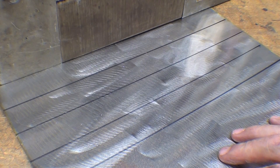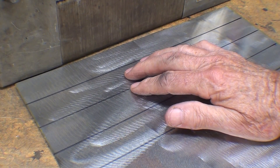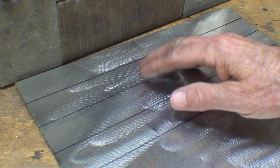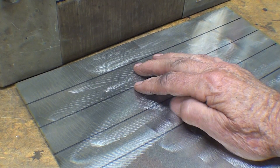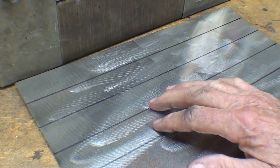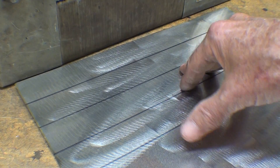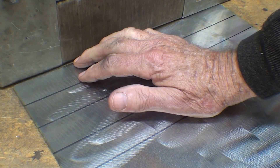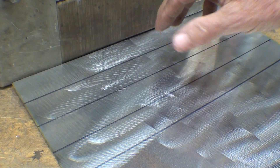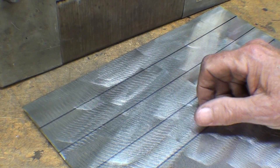This steel had a bit of rust on one side and paint on the other — I ground it off. You're not going to have any luck with galvanized metal; it loads the tip, so avoid galvanize unless you're willing to grind off the zinc. Painted items: you've got to take the paint off. The kids would bring in bicycle fenders and didn't want to take the paint off — well, that insulates it and it doesn't work. You cannot spot weld aluminum. We repaired many spatulas and other devices from fast food restaurants over the years — and the kids would always bring me a 'Be Our Guest' pass from the manager. That's the kind of metal you can weld successfully.